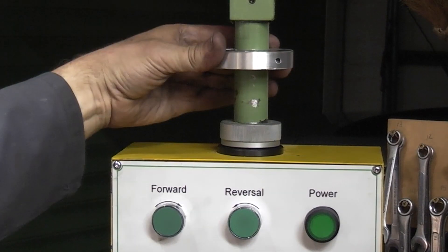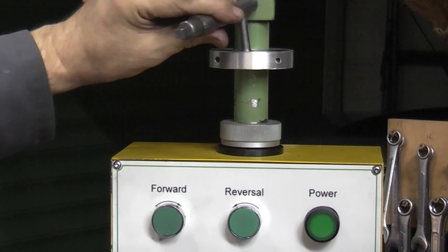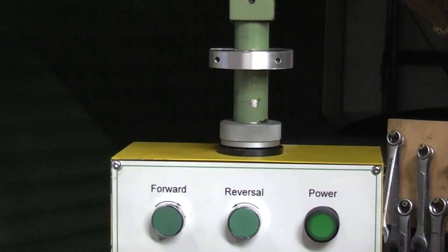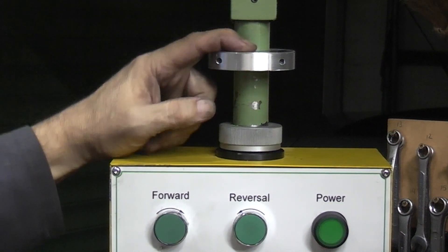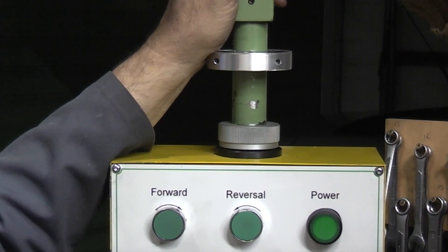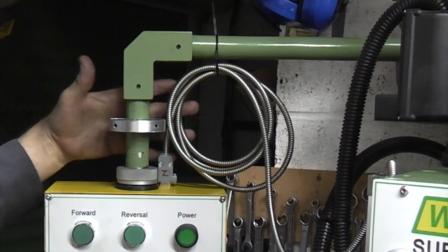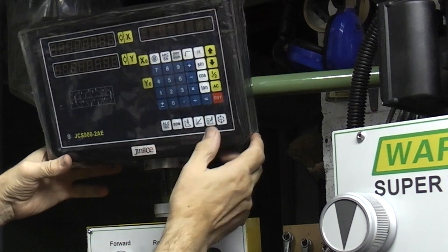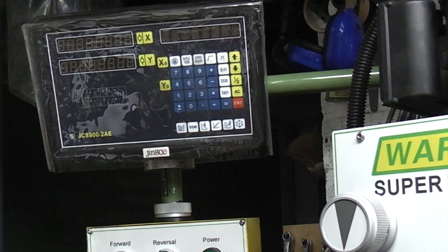Here's the part fitted to the pipe — this is the milling machine control box, and the hole that I drilled in at the front there is so that I could fit a digital readout screen here. Rather than have it on another bracket, this moves in and out and you can twist the bottom, so I thought I'd put the digital readout on here so that it's using the same post without having to drill another couple of holes and fit another bracket. The readout wires will come along this bar at the top into the back of the unit. This is the digital readout display of my lathe — this one has two axes. I've ordered a three axis one for the milling machine and the display cases are exactly the same, except the new one will have three axes instead of two.